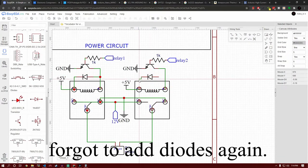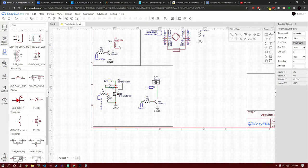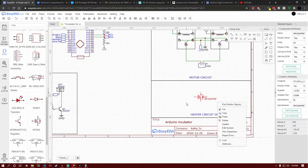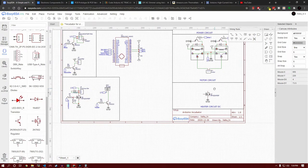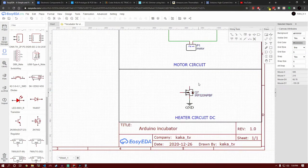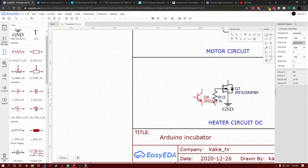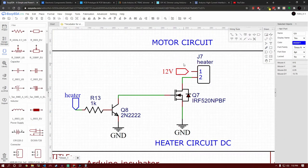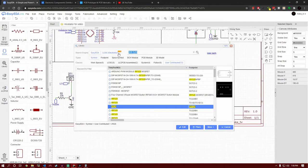Now let's make a heater controller circuit for DC heaters. It's going to be similar to the continuous fan circuit with a few differences: this will require a lot of current, so we need to completely turn the MOSFET on very fast. Since we're going to control the heater's intensity, we need to connect it to the PWM pins of the Arduino. I'll connect the common ground to the source of the MOSFET, one terminal of the load connector to its drain, the other terminal of the connector directly to 12 volts, and then add a discharge resistor to ground.